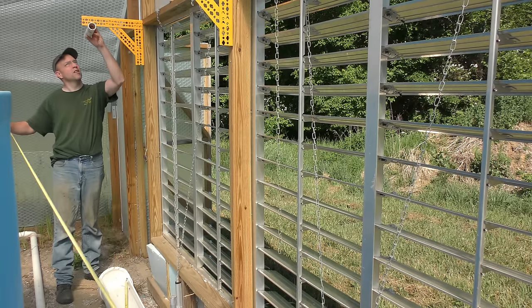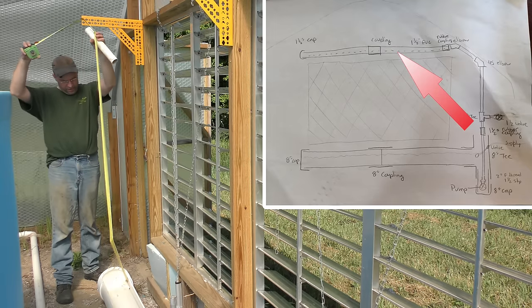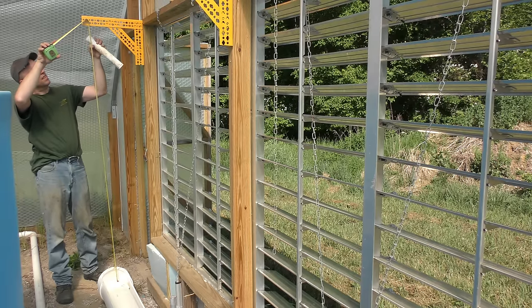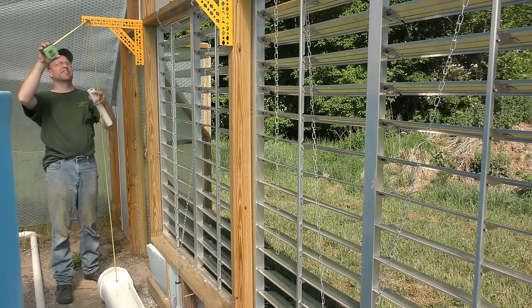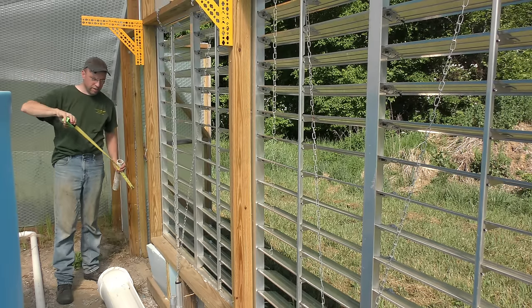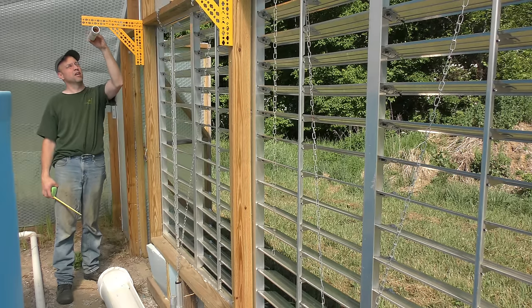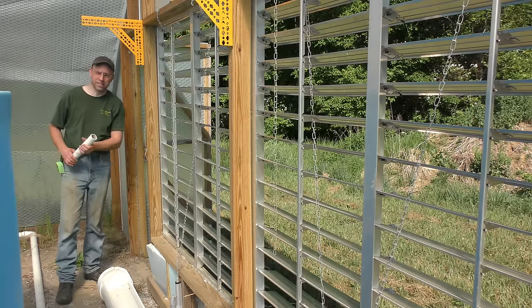The spray bar mounted up under the bracket like this, I have a distance of 5 feet 8 inches of clearance. If I stack 3 bricks on top of each other, I can raise up the trough by 7 inches, so that's pretty good. So I'll raise that up and that'll bring the top of the pads right up near the spray bar, and that'll help reduce some of the spray out, getting it to go all over the place.